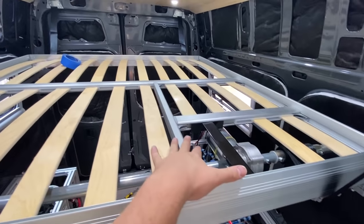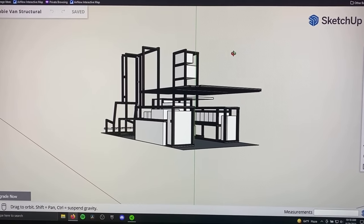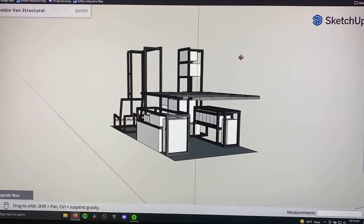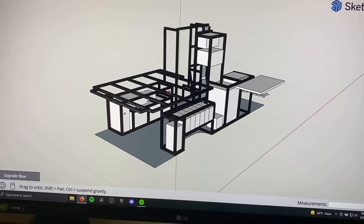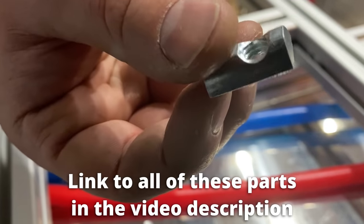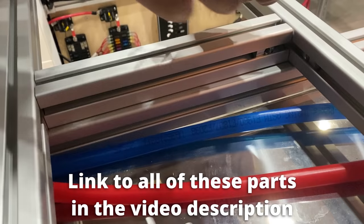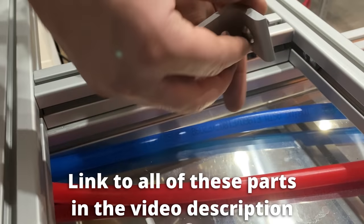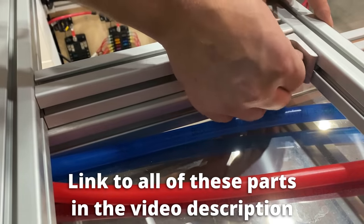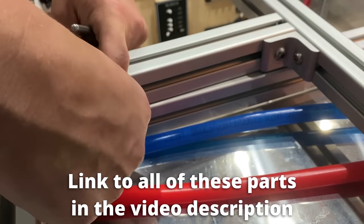We are basically going to delete this entire bed frame as it came and make our own 100% custom bed frame. Before cutting our expensive 80/20 aluminum extrusions, I made a quick mock-up of what the bed platform is going to look like. Building with 80/20 is very simple — I use T-nuts that slot directly into the slots on the aluminum extrusions, then use a small bolt and an 80/20 angle bracket to attach each extrusion to the next.